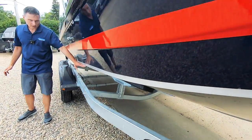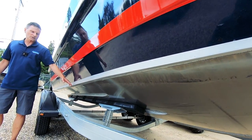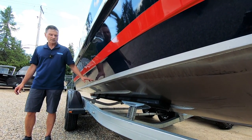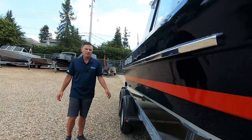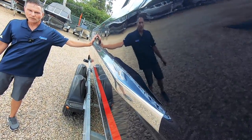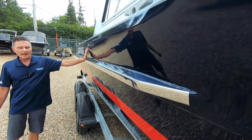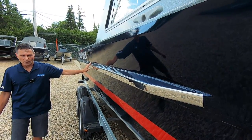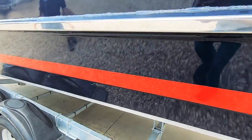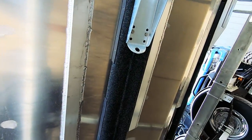We don't paint to the very bottom. The reason for that is if you ever beach the boat, the pebbles and gravel on shore won't put chips in the paint, so it's going to stay looking great for many years. This rub rail is a heavy duty option on the boat. The boat comes standard with 0.125 — one eighth inch — sides on the aluminum, and the heavy duty rub rail is an option. The bottom of the hull comes standard with 0.190, which is 3/16ths, and there is an optional quarter-inch bottom, which is what we have on this particular hull.